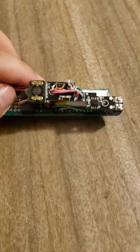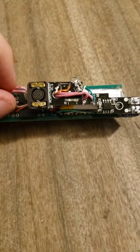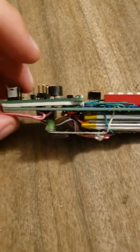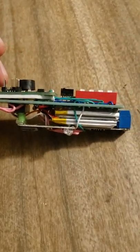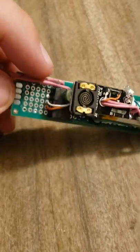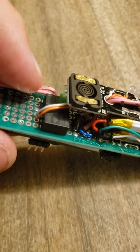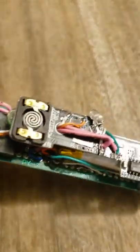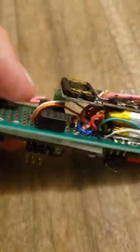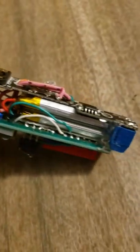On this side, this is the board from that electric cigarette lighter. This is the actual heating element here. And in between all this is a little prototyping board. I've got the two LiPo batteries, the relay that actually controls the power going to the heater coil — to the actual switch for the cigarette lighter. That's the orange and white wire you see there. The diode right there isolates one battery away from the other.